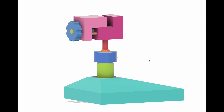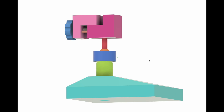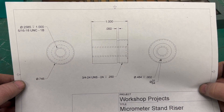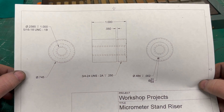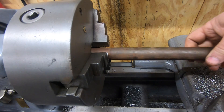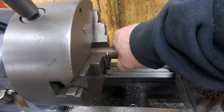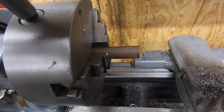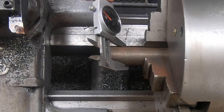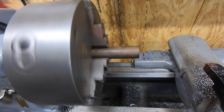Welcome back to the shop and to the channel. Last week I machined the base for my micrometer stand that I designed in Fusion 360, and this week I want to machine this riser as well as the clamping nut that attaches to the top of it, which facilitates a swivel joint. I'm going to machine the riser from this piece of mystery metal - a one-inch piece of bar stock from the scrap shelf, currently measuring a little more than one inch in diameter, so I want to machine it down to about three-quarters of an inch.